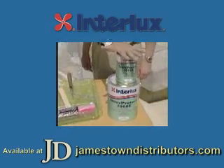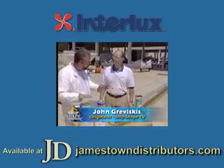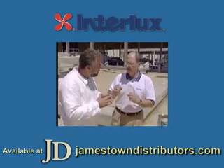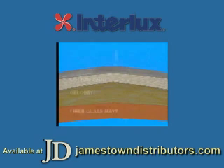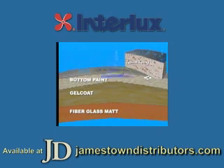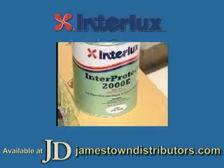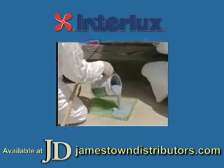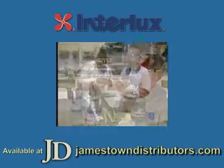What we have here is something called an epoxy barrier coat. It's a two-part epoxy, but it's a special type of product. A typical epoxy primer would have resin and pigment in it, and you can visually see that in an electron microscope - pigments in round formations, not unlike gravel in a driveway. That's not ideal for underwater application because water can pass through it just like rain through a driveway. What we've done with these water-resistant epoxy primers is build a leafing effect within the primer itself - it works like shingles on a roof where you put multiple layers of pigment, and water cannot find its path through. That goes on top of the gel coat, giving you the benefits of the gel coat plus the epoxy primer - your best way to prevent blistering.